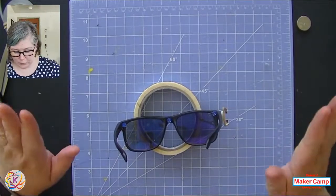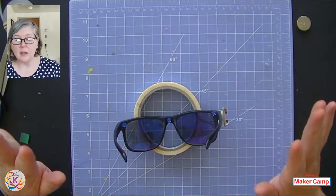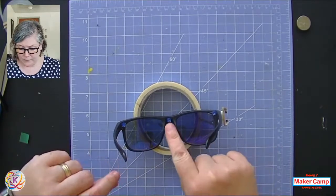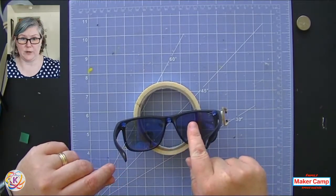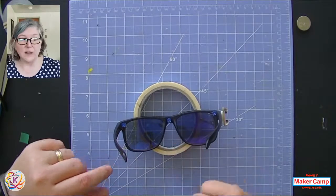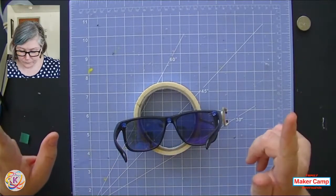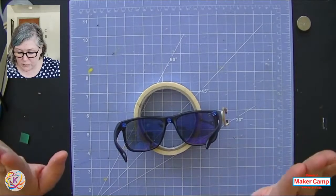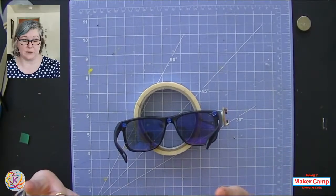You do not want to hot glue anything into place at this point, because it is very possible to accidentally break one of the leads from your LEDs at this point. And if that happens, obviously the circuit won't work. So my suggestion to you is to wait to hot glue anything in until you're done prototyping.